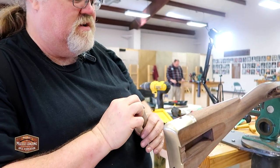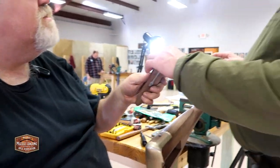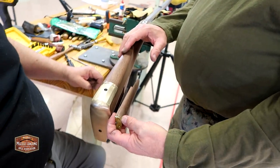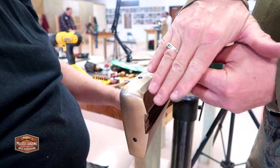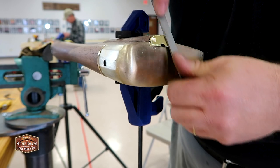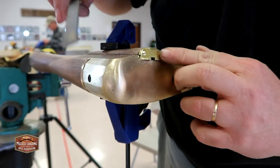So now how do I file these things down? Should I just take it over to the grinder and file them down? No — I would take the spring back off, put your plate and your box lid back in, then flip this on its side and go with the file this way. The student now files so that the surface of the plate and the screws match with the established butt plate.